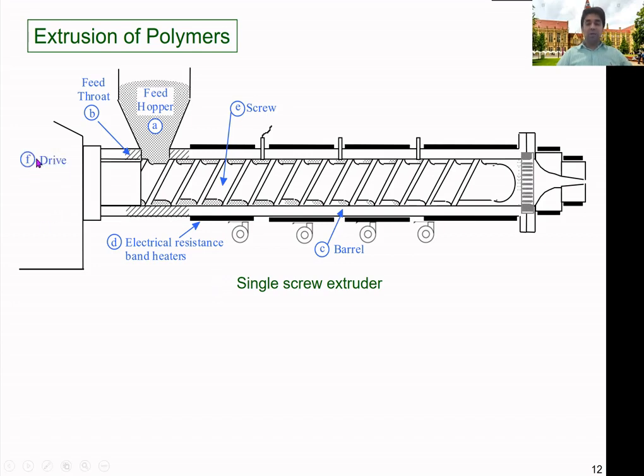Here is the drive — the unit used to rotate or turn the screw. It could be a DC motor, AC motor, or hydraulic drive. The most commonly used for small extruders is the direct current motor, but nowadays AC motors or vector-controlled AC motor drives can also be used. Normally there is a gearbox between the screw and the drive, although new extruders can come with a direct drive where the motor shaft is directly connected to the screw.